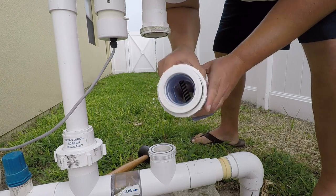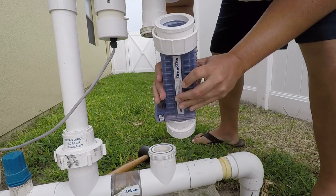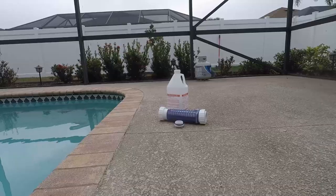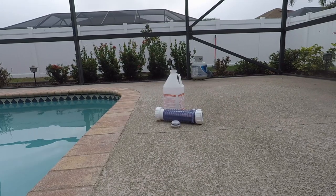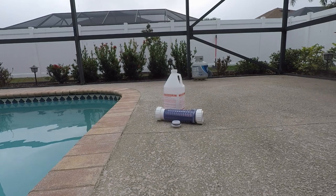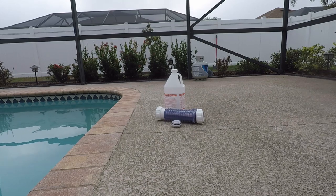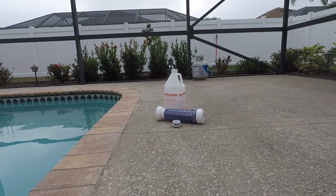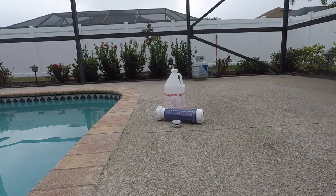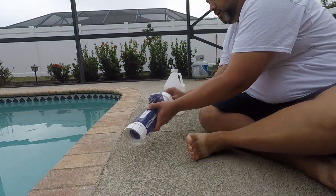Today we're going to show you how to clean off a little bit of scale and buildup on there. It doesn't look like much, but let's go ahead and clean and see what we can get. So this is the next step. We're going to need some muriatic acid, our salt cell, some pool water nearby, and this little 1.5 inch plug, and you'll see why we use that. This is on Amazon. I've got a link below on the video if you need something like this. Essentially this is just to stop water from falling out one end of the salt cell.